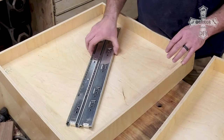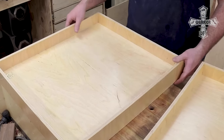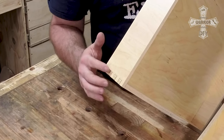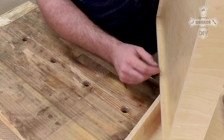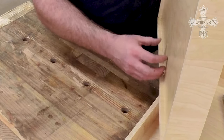I built the drawers here so I'm just going to cover that process really quick. The camera portion wasn't working too well so I don't have much footage, but I'll review a little bit how I built them. These are the drawers I built for that cabinet — they're almost identical. I created a box joint here, which are like fingers that interlace. I also routed a groove a quarter inch into this half-inch plywood for the half-inch plywood bottom to sit in, and gave myself a half inch of material for it to rest on.